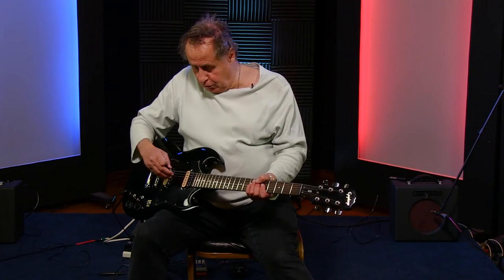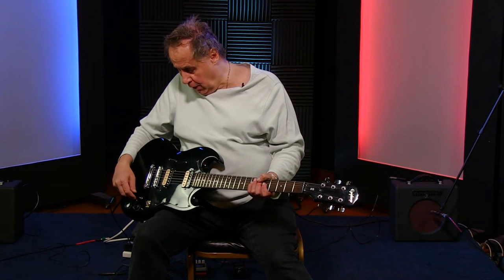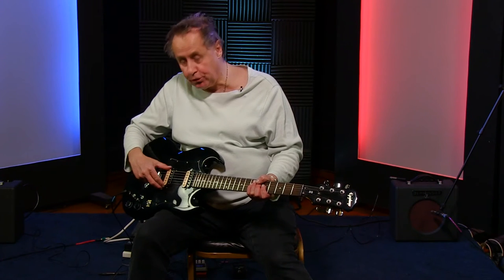But on that other guitar, if I was to plug in just a mono jack, I would get the two pickups, the two white pickups that were on that guitar, in parallel, and I can blend either one. Now, I can't do that on this guitar because that would take another switch. That would have to switch it over to a parallel effect. The single coils are running, actually there's four coils, and they're running in series. So this switch here switches it from just using one pickup to adding the other pickup in a series configuration. That you can see on the meter.